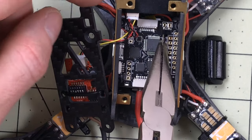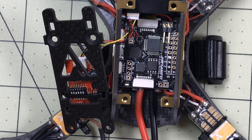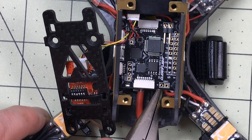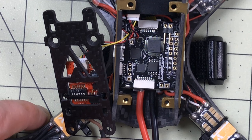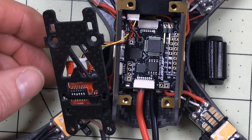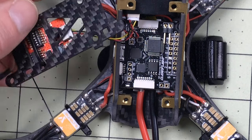I'm going to put these pins right here in the buzzer spot on the board and solder those in. That does fit - I'll leave a little space so there's room to connect. I like the buzzer to be modular so I can take it off if I need it. And then the VBAT pins I need to solder up so I can actually use the telemetry. If I hook up telemetry without having VBAT, it won't do me any good whatsoever. So I need to solder those up also. In order to do that, I think I am going to have to remove this top card - the flight controller.